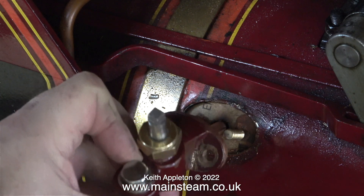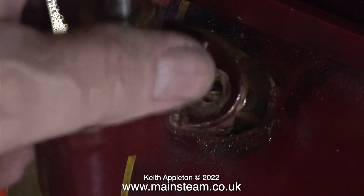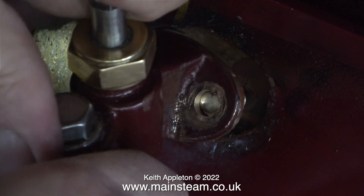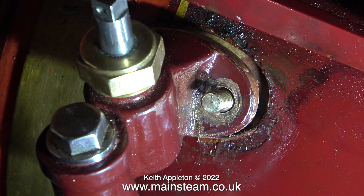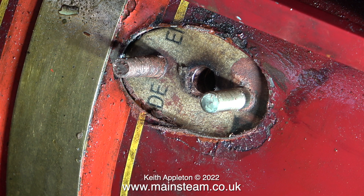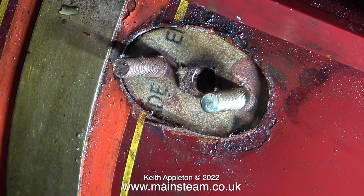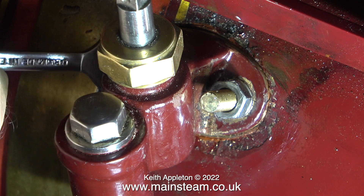Out of the workshop and into the garage to see if everything fits — and of course it doesn't. The holes are not lining up with the studs properly, mainly due to the fact that the hole in the boiler bush is not exactly in the centre between the two studs, and the hole in the check valve isn't in the centre either. The solution wasn't too drastic: I stuck the pipe into the hole in the boiler bush and bent the check valve into the correct position, then I enlarged the two holes in the check valve's flange to one drill size above what they were. I've actually fitted a couple of O-rings between the pipe and the body of the check valve. In a perfect world this will work fine and there will not be any steam leaking.